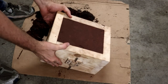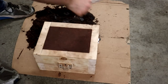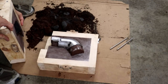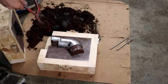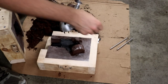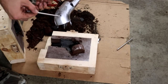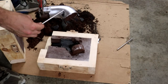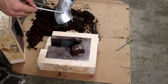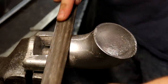This is the fourth and last one of the night — hopefully another good one. The first side looks pretty darn good. The other side didn't quite fill out right — there's a little bit of a void in it, unfortunately. Really nice finish on this one though, it's really nice and smooth. It's a shame it didn't quite fill up. The following morning I made one more casting, and I was also really happy with that one. So out of the five I made in total, I had two that I was really ready to proceed with.